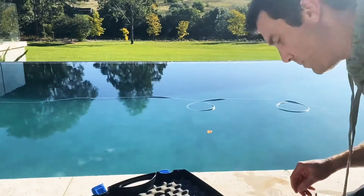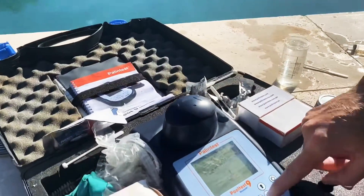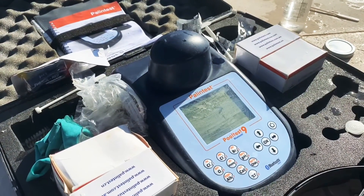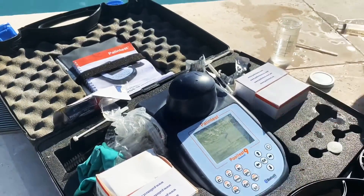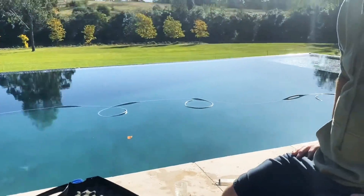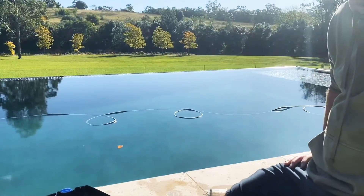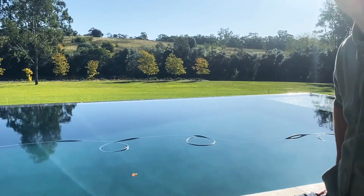Sample goes in, hit okay. Above — so that arrow means above. That's not a good sign. That means that your pH right now is over 10. We've got to bring that down to between 7.4 and 7.6.